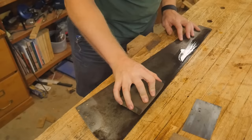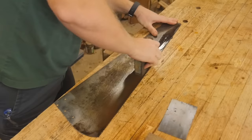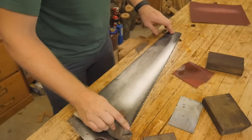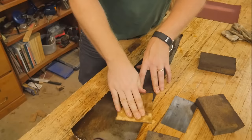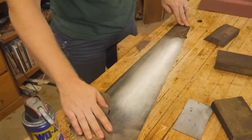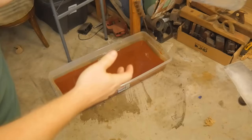For the actual plate, I use WD-40 and start with about a 60-grit sand block and just grind on it, trying to get through as much of the grime and old rust as I can. This saw plate isn't that bad, so that's why I'm not doing a vinegar dip. I'll go 60-grit, then 80 or 100-grit, and finish up with 150-grit sandpaper. Each side ends up taking me about 20–25 minutes. It's slow work, but you end up with a really nice surface, and it's a great way to try and save an etch if it's on there. You still have to be careful not to sand through the etch, but this is one of the least destructive methods. Then you get left with a nice finish.